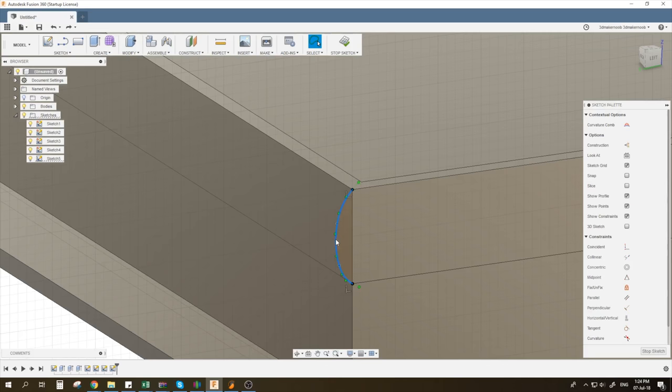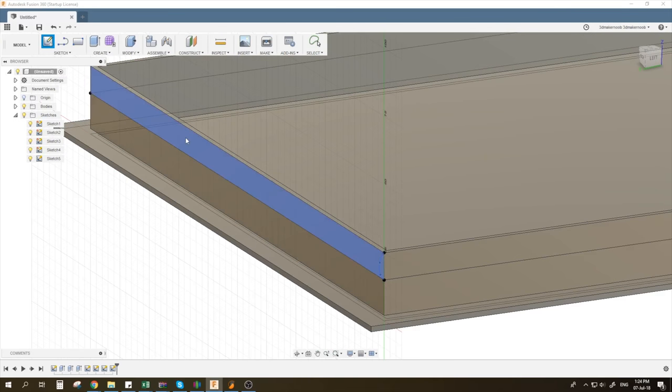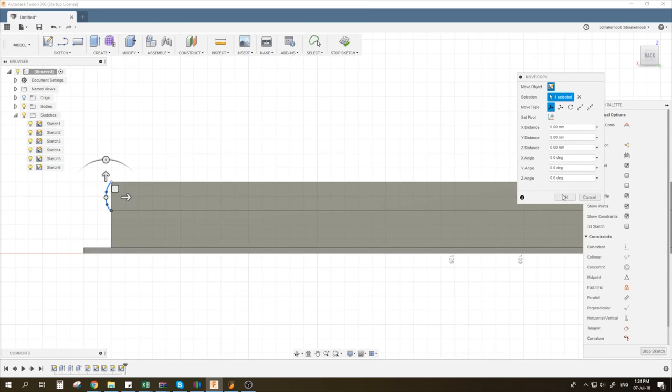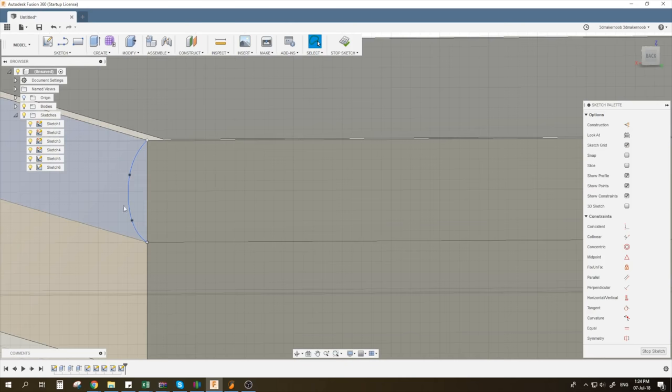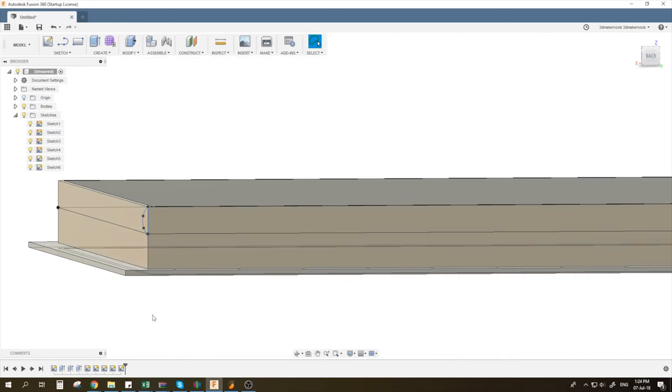Now, in order for me to copy that spline onto the other faces and be able to extrude it, I'm just gonna copy it. So Control C, I'm gonna stop the sketch. I'm gonna create a new sketch on that plane and paste. And as you can see, it automatically goes there. But if I hover over it, I cannot extrude because it goes onto this face. So what I'm going to do is simply draw a line from there to there, and now it's closed off. I'll stop the sketch once again